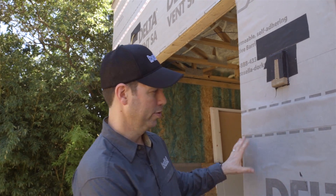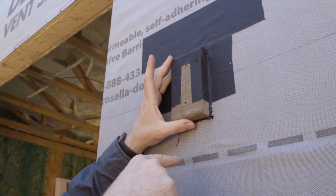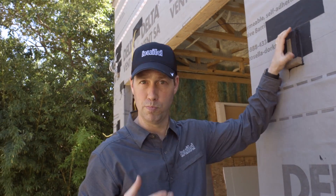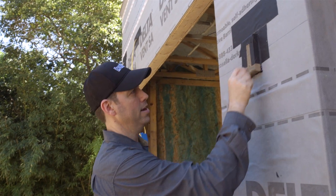I thought this detail that my project manager came up with was a great idea. We've got a stucco facade going on here, but we didn't want to bolt through the stucco for those metal awnings. So what he did was he took a piece of Trex — that's a composite wood, it's plastic and wood combined, it won't rot — and he cut that.